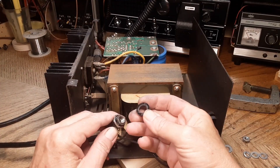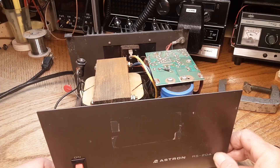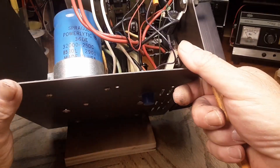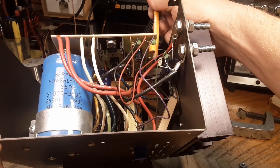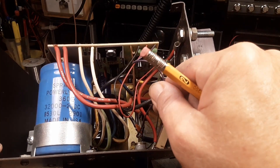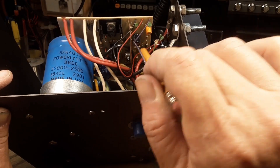The fuse holder was broken off. This appears to be a much older version than the RS20A I have on my other table. What's interesting about this one is it has over-voltage protection in it. Right there you can see the SCR, and up here on this circuit board there should be a PNP transistor — that guy sitting back here. There should be a capacitor coming off the collector of that PNP going to the gate wire of the SCR, which is up here in the corner. There should be a couple of resistors — which there are — and a Zener diode — which there is down there.